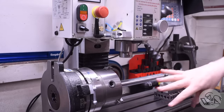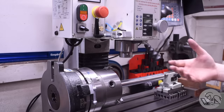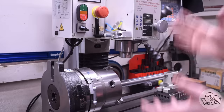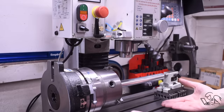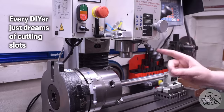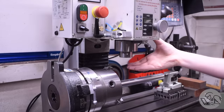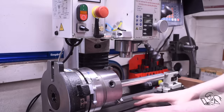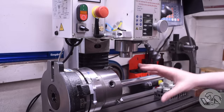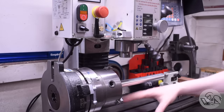A lot of beginners want to start with a milling machine, and I think it's because milling machines are intuitively more obvious. We're used to things like drills where the cutting tool spins and the work is stationary. The beginner looks at a mill and says, oh, it's like a drill, except I have a way to move the work - and therefore I can see how that's useful. But this is actually the wrong way to think about machine tools. The way to think about a machine tool is they are a highly precise and rigid spindle with some form of work holding. So the lathe and the mill are really the same thing - they're just different orientations of the same tool. In fact, all machine tools are just optimizations of what lathes can do.